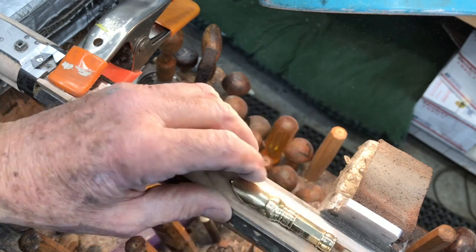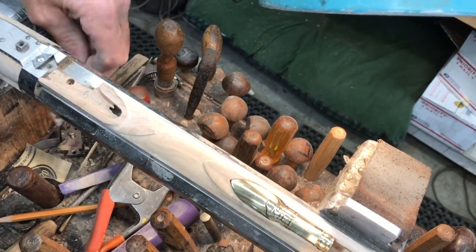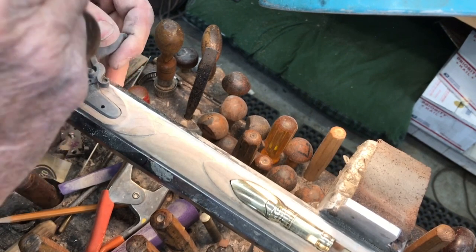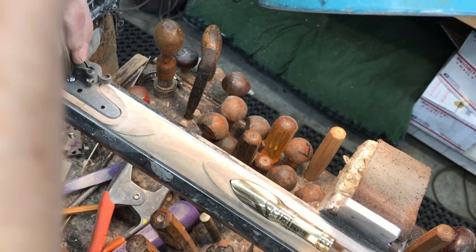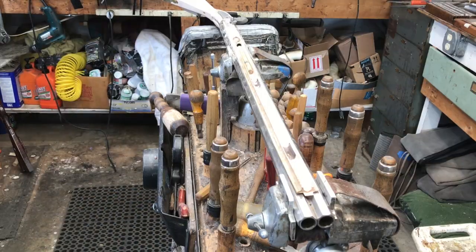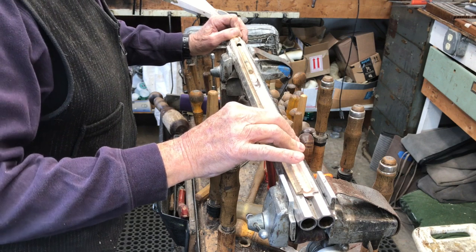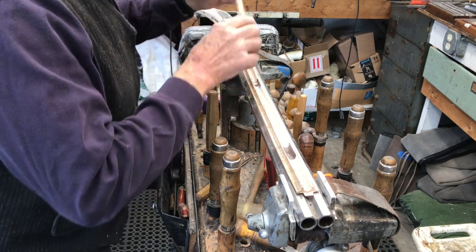Now we pop that thimble in there. Put this frizzen back in here. Finish this, the moldings here around the lower thimble. So I think it's time to trim off the width of the panel itself and lower the top edge of the ramrod groove. So we'll take this thimble out.